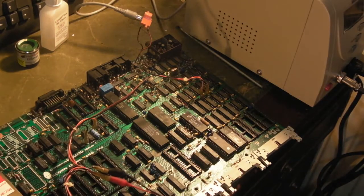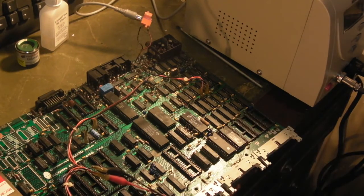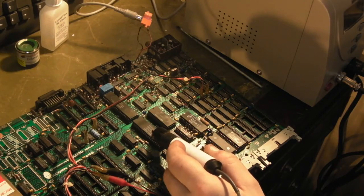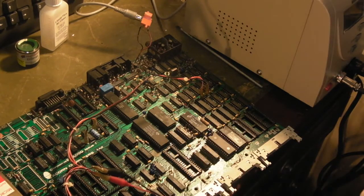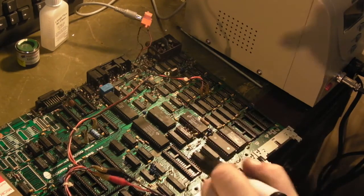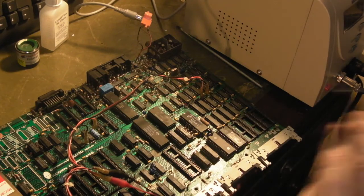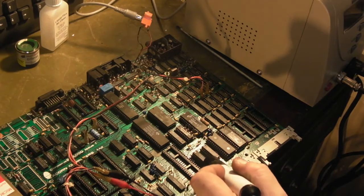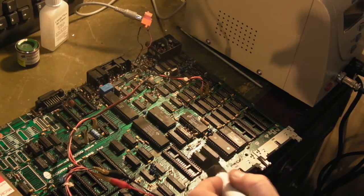So I think we're pretty confident we've got a good contact now between that and the CPU. I suppose the next thing to do is really to pin everything out. I'll check all the data and address lines straight through onto that chip from the 6502, and make absolutely sure everything that should be getting from there to there is doing. But we've gone over that damage again and made sure it was absolutely right, and honestly, I couldn't find any more than them three breaks in it. We've repaired them in a better way.